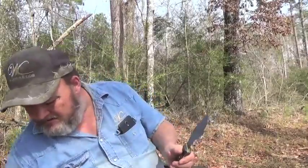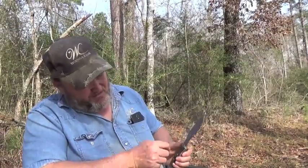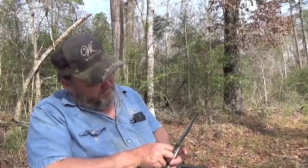But it feels a lot better in the hand than revision 3 in 01. I don't know, maybe it's not the holes in the handle. But I'm wondering if it's the blade length, if I got the blade too long. So that's 5 3/4. And this is 5 7/8, so that's 1/8 of an inch difference. Man, it shouldn't make that much difference though. So maybe it's this part here.